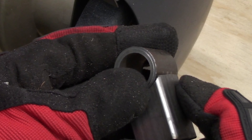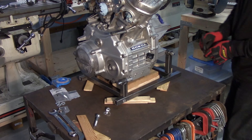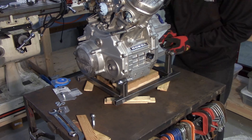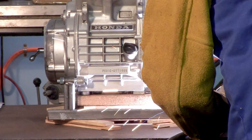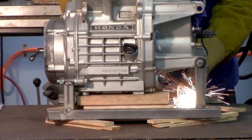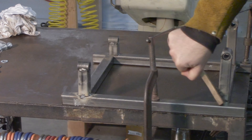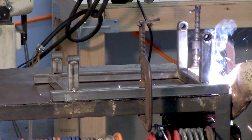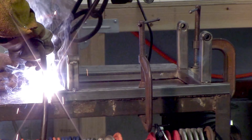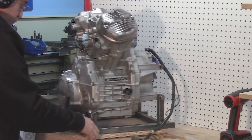I cleaned the edges of those newly cut pieces on the grinding wheel to prepare them for welding to the round tubes. They looked pretty good, so I jigged them up in a vise, turned on the welder, and tack welded the edges. I put all the pieces in place with the engine supported on some wooden blocks to check alignment and get ready for welding. I then tack welded the posts with the MIG welder, rotating sides and corners to minimize distortion. I removed the engine from the base and cleaned the tack welds to prepare for final welding, again rotating faces, corners, and edges to minimize distortion. With that I put the engine back into the test stand base and placed the engine and base onto the Lazy Susan on the workbench.